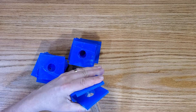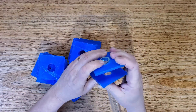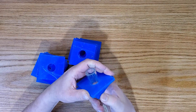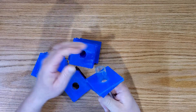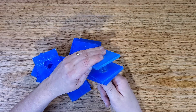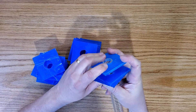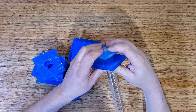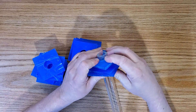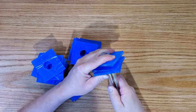So what I've done up to now is I have cut out a bunch of discs. There are a number of ways of making an Archimedes screw. First off, I could have simply taken a piece of flexible hose, wrapped it in a helical pattern around a piece of acrylic tubing like this, or anything else for that matter. And once that's spun and one end is in the aquarium, it is an Archimedes screw — I could have built one as simply as that.